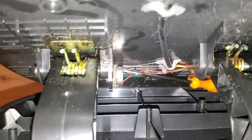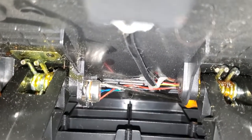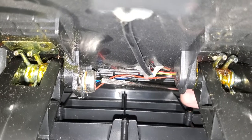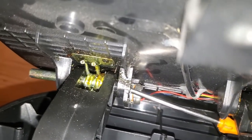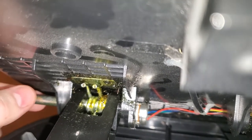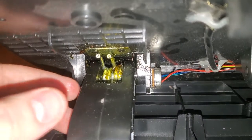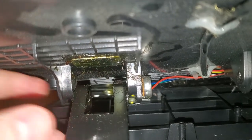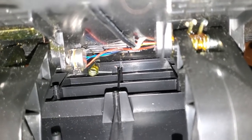You can't separate both parts because the top of the pedals is a bigger piece of plastic. The only way to do that is by removing the big pins that hold everything together. You can see there's a bigger side on the left and a smaller side on the right. I'll push with my screwdriver — yeah, I can pull this pin out. It's just walking right out, and it's greasy.